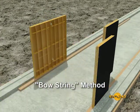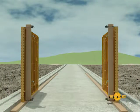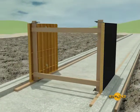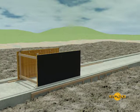The two inside walls will be erected first. At both ends of the box culvert, a squaring frame should be attached using vertical aligners to maintain the proper width and ensuring that the box remains square during erection.